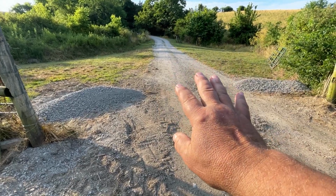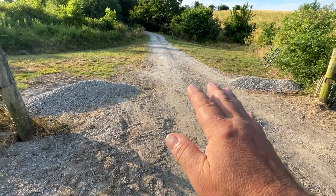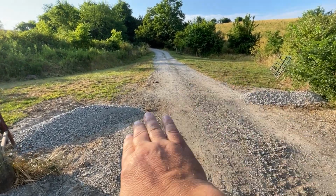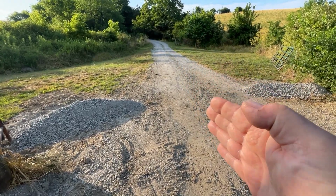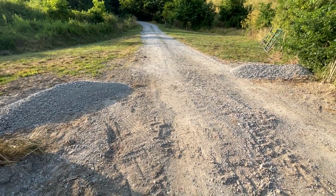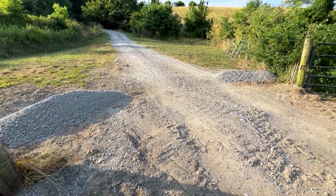You want maintenance on, I can tell you all kinds of maintenance on gravel roads. There's not a lot if you do it right, but you got to do it right. And crowning makes a huge difference. That way the water runs off instead of coming a little bit, and all of a sudden you got a river by the time you hit here, and then it fills up your cattle guard. So we will drain it off properly.